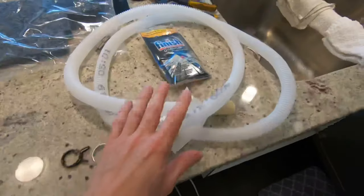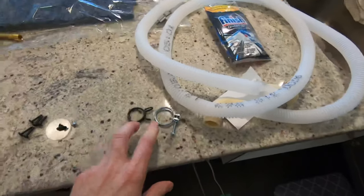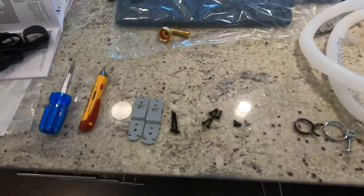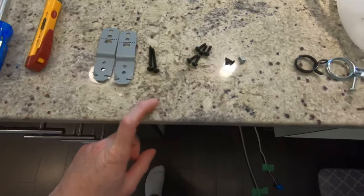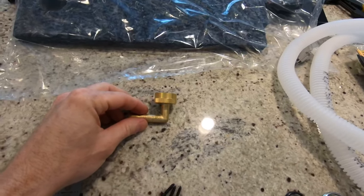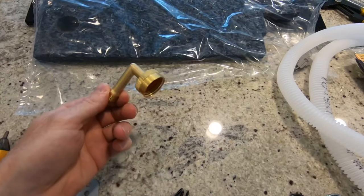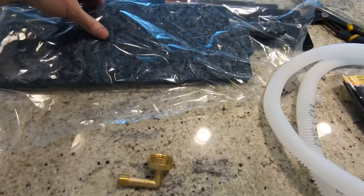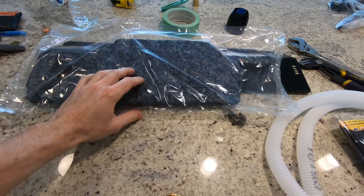The third is the water drain line — all the dirty water has to go somewhere. This is usually supplied with the dishwasher, along with drain line clips and some other stuff. There are brackets you can use on top of the dishwasher or on the side — useful if you have a stone countertop. You'll probably need a 90-degree elbow as well, which can come in any dishwasher install kit or may be supplied with the dishwasher. The last piece is the kick panel with the soundproofing or acoustic foam that it comes with.